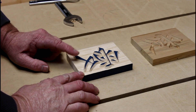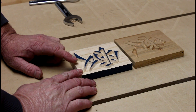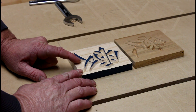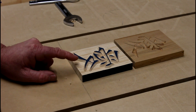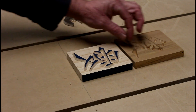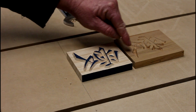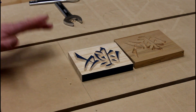The male part is a mirror version of the female piece so the two fit together. But when I set the program I set a start depth of one and a half millimeters. What this means is that if machined normally, the width at the top of the male piece would match the width of the female opening — that would be with no start depth at all. Because I set the start depth to one and a half millimeters, the point at which the two widths match will be one and a half millimeters below the surface — and that's the real secret to this particular method.